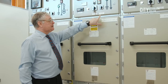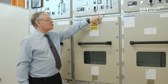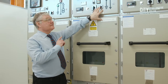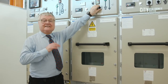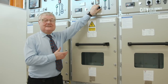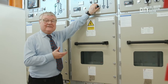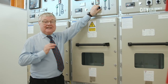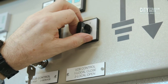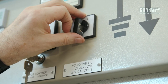The first job I will carry out is to open the actual circuit breaker. VCB control: number one local close, number two local open — and I'm going to take it to the open position from the closed position. Naturally I would first check that the old man isn't using the bow thruster, because if I take it offline while he's using it he wouldn't be very happy. We will now open the circuit breaker — that's it, to the open position.